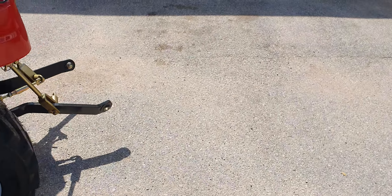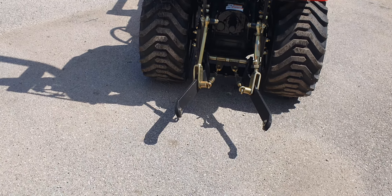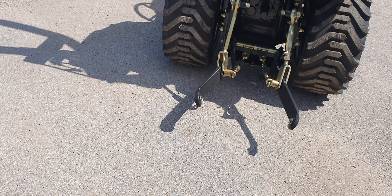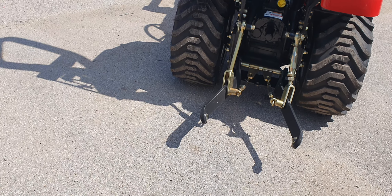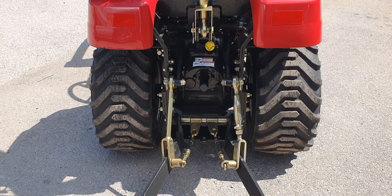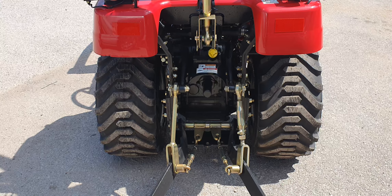Rear lift is going to be about 1,100 pounds back here. We usually put the four-foot implements on this tractor — I wouldn't go any bigger just because the PTO horsepower is only about 14. The PTO horsepower on this one is exactly 14.2. I do have another video on here where we had a post hole digger that we had to manufacture, so we can actually put it back here. There are smaller post hole diggers that you can install back here, but we actually manufactured the one that we carry.